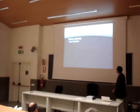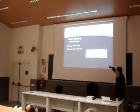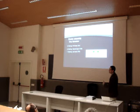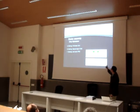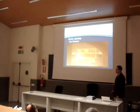Then I wash away with an etching process where I etch all the gold and all the photoresist that is not being cured. And at the end, I made a step that is called stripping, where the photoresist went away. So at the end, I have only the glass wafer with the metal. And this is the result.